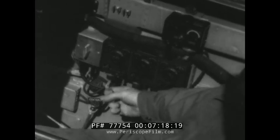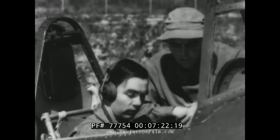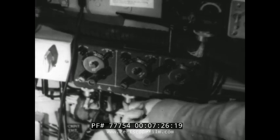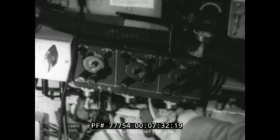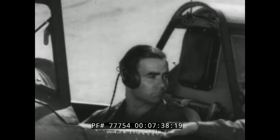The sergeant is checking a control box, trying to spot loose connections. When you bang the controls, bad connections show up as a definite trouble noise. But even if you hear nothing, make sure everything's tight — safety wires, plugs, lock rings, and cables. And that, Jones, winds up the receivers.